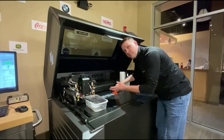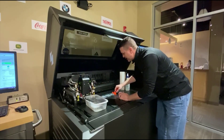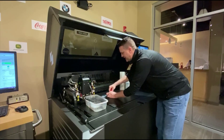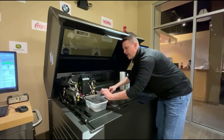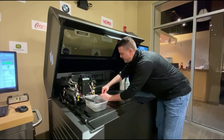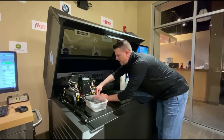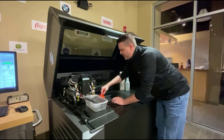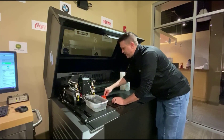These razor blades should be part of your kit when you purchase the system — you'll get these tools, or if not they're pretty easy to purchase. Slowly walk off the little layer of model material that doesn't really adhere; it just creates a foundation for the part to be built on top of the build platen.